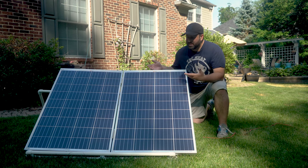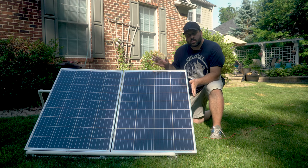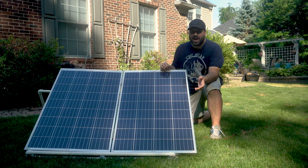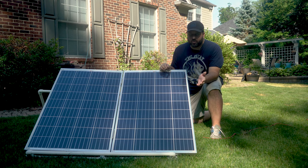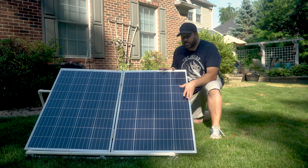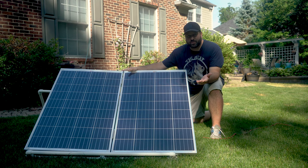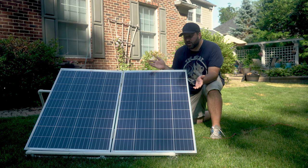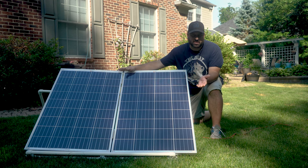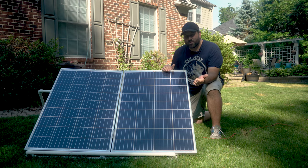For the solar side, a lot of people sell foldable 100W solar panel systems — two 50W panels folded together — but they are expensive: the cheapest I found was about $240, going up to $300 for 100 watts. So I DIY'd my own folding system built from two 100-watt panels. This is a 200-watt folding system. Each panel was $79 on Amazon with free shipping, so $160 total for double the output. The two hinges I put on cost about $2 each. It's a bit more of a hassle as a DIY system, but it's fun to make and you get more power — win-win.